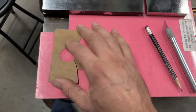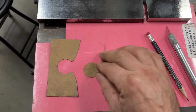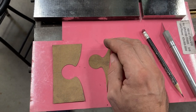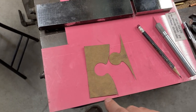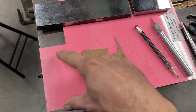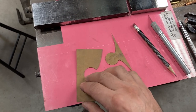So I'm going to make my pattern out of some of this thin pink G10 I haven't used in forever. And don't worry, you can still have a pink G10 handle on your knife. I have 1/4 inch stock too. I have measured out a line from the factory cut edge out to 3 7/8, so this inscribed it out long, so I can just use this as a strip to make patterns out of.